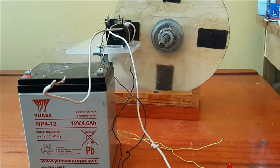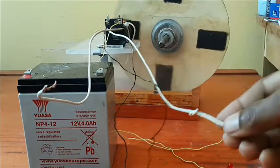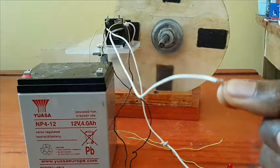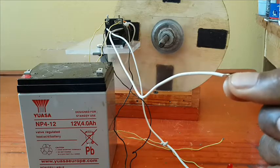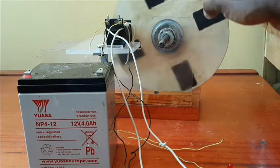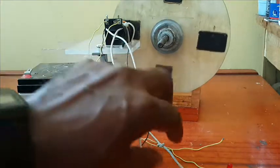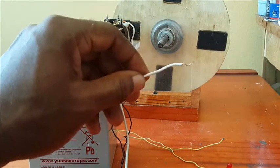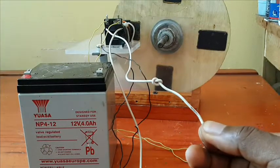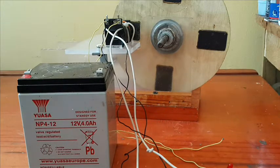Now it's rare that people drive their motors in attraction mode. If you want to run your motor in attraction mode, you place the end run on the start run on your circuit board. And instead of pushing away, your motor will be pulling at a magnet. If you go in repulsive mode, you put your start run on the start run and your start trigger on the start trigger of the circuit board, and your motor will run normally.